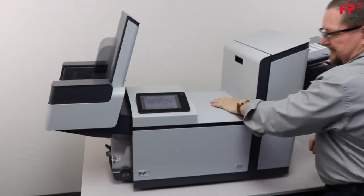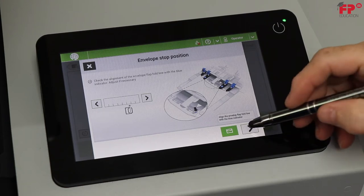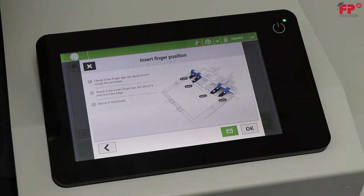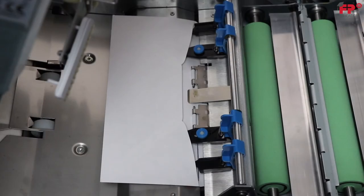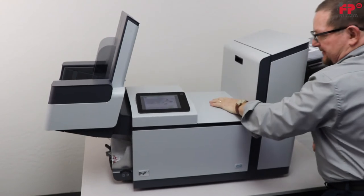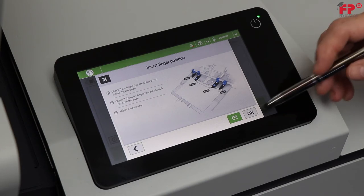Close the upper unit. Touch the right arrow to check the opening of the envelope by the fingers. The specifications are shown on the screen. Open the upper unit and check to see if the fingers are inside the envelope, adjusted correctly for the envelope size, and to make sure it is only opened enough to allow the insertion to occur. If the fingers are not adjusted correctly to the width of the envelope, or depth is not correct, a stoppage can easily occur at insertion. Depth is adjusted with the envelope stop position adjustment on the previous step. Use the arrow in the lower left corner if the finger depth is too deep. Otherwise, select OK.